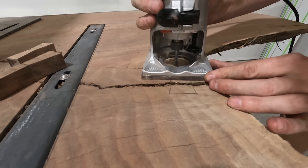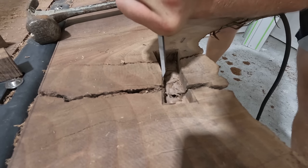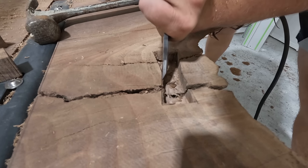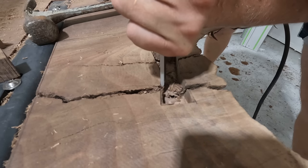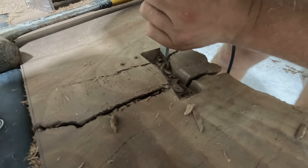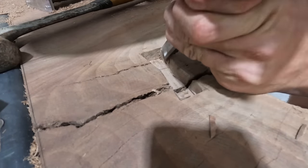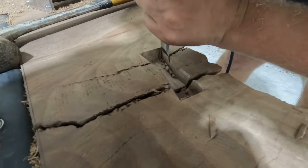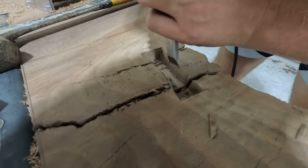The slab was close to 3 inches thick. When you watch most other people's videos, they're using some pretty badass chisels, but these are just some $30 Stanley chisels — they work good. It's pretty important to take your time though. If you try to rush this and you end up pushing over on your line or getting too wide, you're going to see it, and you're going to have to make another bow tie a little bit bigger and do it all over again.